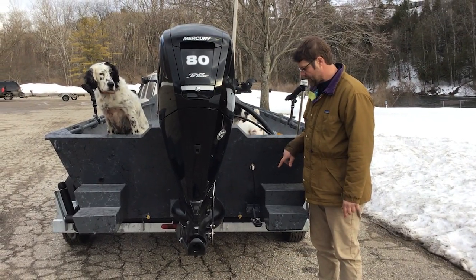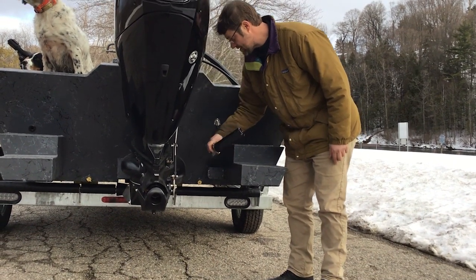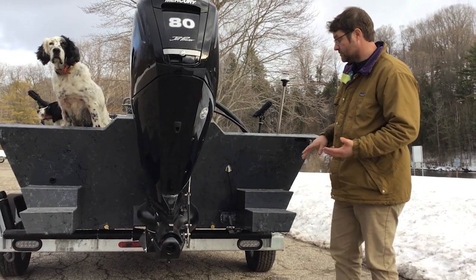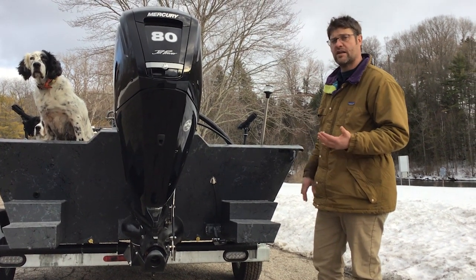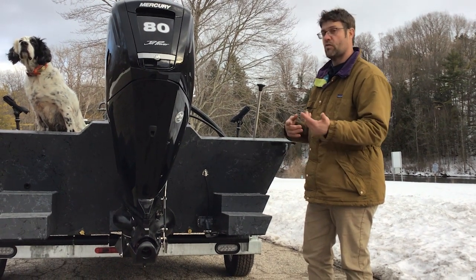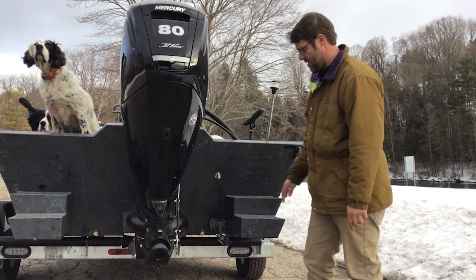One thing I want to show before we take this on a spin is the back end, because you won't be able to see it as well in the water. For the electronics package on our aluminum boats, we weld a piece here so the electronics have somewhere to bolt onto that's not through the hull. There's also a breakaway transducer — when you hit something it releases. One thing to tell guys buying fancy electronic systems: it's a flat-bottom boat, so at speed — anything over 15 miles an hour on plane — you'll sometimes get mixed readings, because these transducers are truly made for a V-bottom hull where they sit deeper in the water. You might be at one inch of water or less. At high speeds in a jet boat you'll usually get bad readings, but you can still run the GPS and do a whole bunch of things with it.